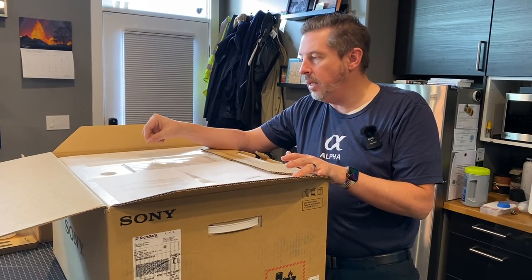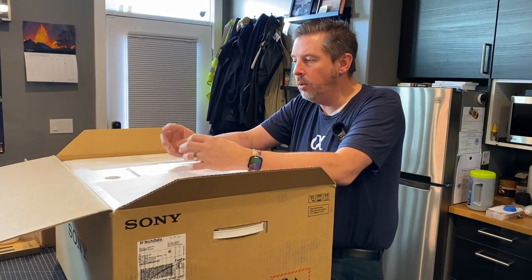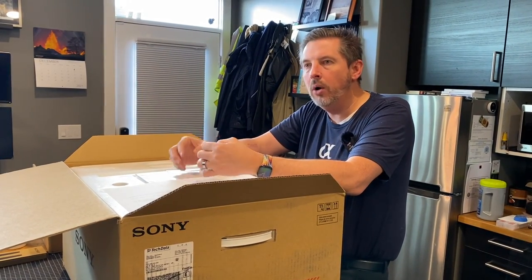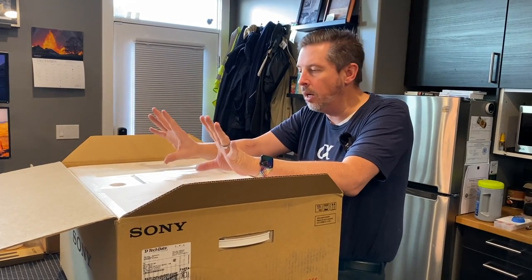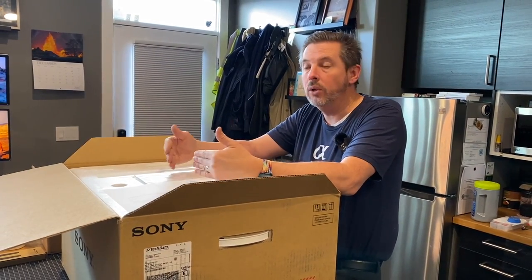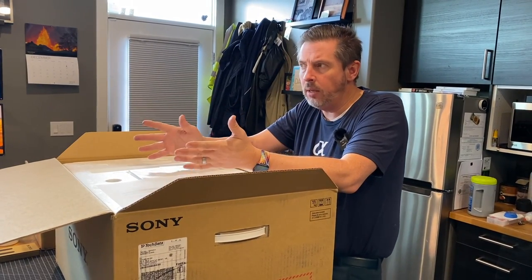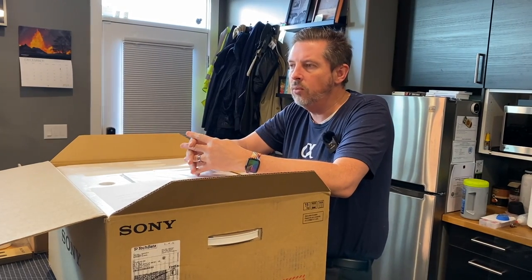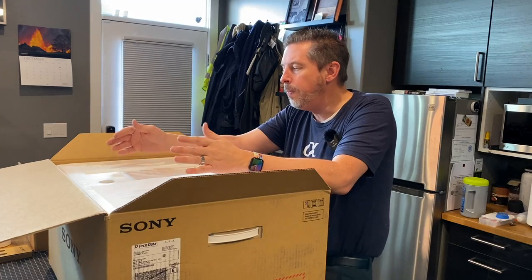But I ended up modding the remotes for those, where you put a couple of connectors on the back of the remote and then put a couple of big flat panel antennas on there to make it very directional, so I could aim it at the drone. Basically, I'd say it was 50% more distance I got out of that.